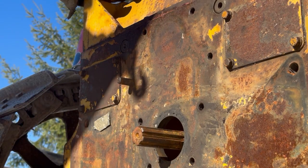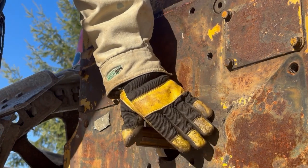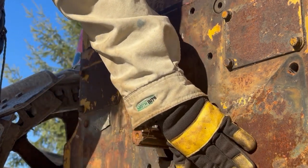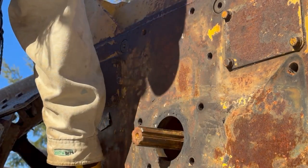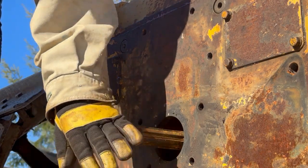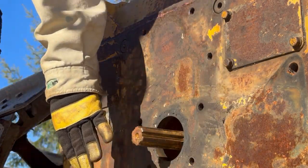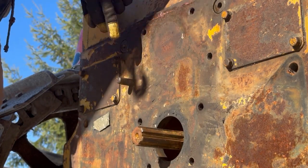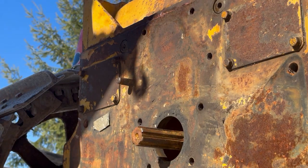Okay, the case is pretty much sealed up in that regard. Got to get the winch in, and it covers these final drive oil. Like, that's where you put the oil in for the final drives and check the oil. So there's a casting on that winch that just covers this whole back end here, including these big shafts there that handle the steering clutch rockers.